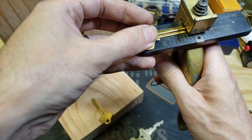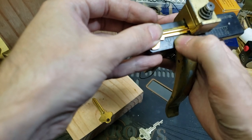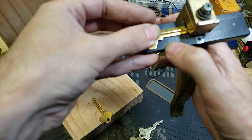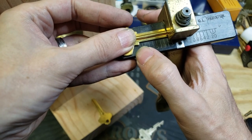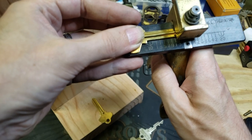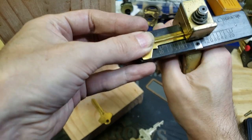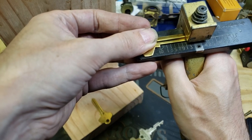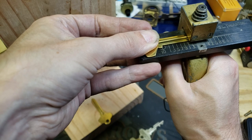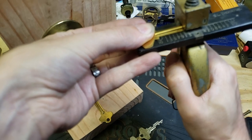To use this, we insert the key like so, aligning the edge with this horizontal line, and we move it until the shoulder of the key matches up with this hash mark. We want to cut 10. The tip cuts require 3 passes, and you do kind of have to choke up on this thing.